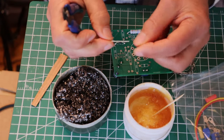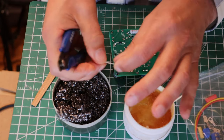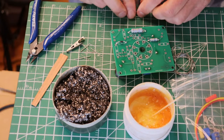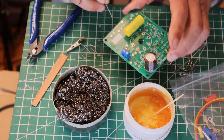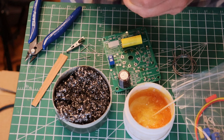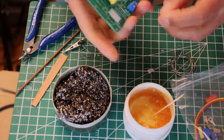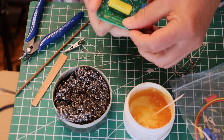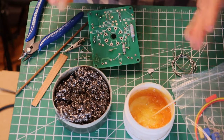Here's a little pro tip. On many capacitors they have nice, heavy, extra-long leads. Save these in a little container because if you need a jumper on a board, these are just fantastic. This board actually has some spots where you can put a jumper — this one is marked jump six. So let's just make two 90-degree corner bends like this, press it in there, bend your leads back, and solder it on just like you would a component, with a little tiny dab of flux.